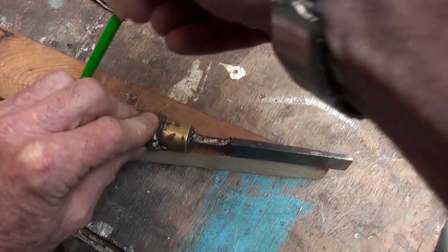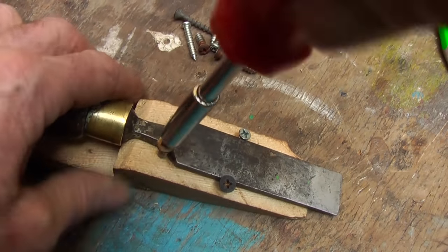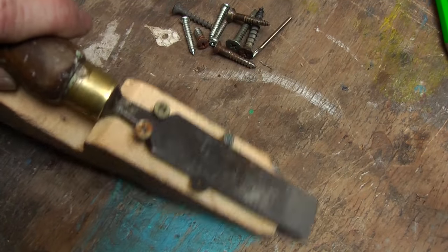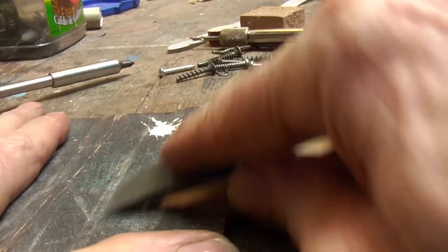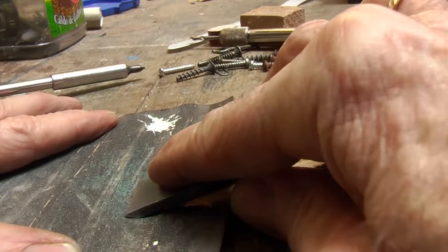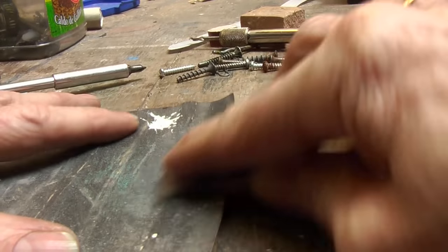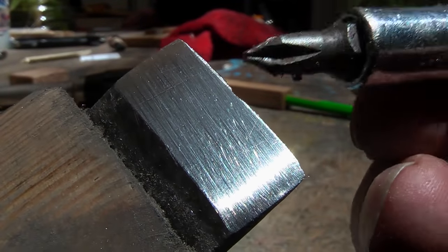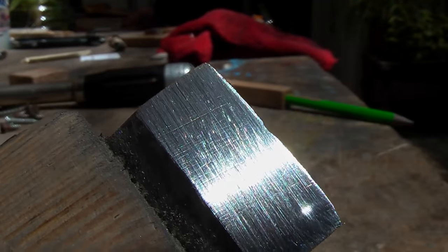You may have to take into account the handle as well and take that piece out the back. You should have some screws on site, so just screw that on there to attach it so that this point here is running on the bench. Then on some sandpaper on a flat surface you can use that guide to get it sharpened at 26 degrees. I used a belt sander as well — it's a lot quicker if you have one on site. Keep at it until you get rid of that line on the leading edge, because if you can see that line it means it's blunt still.